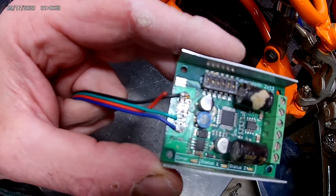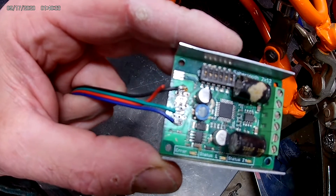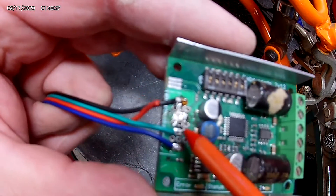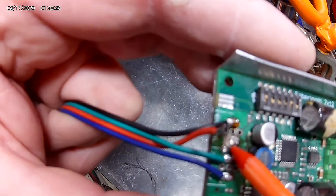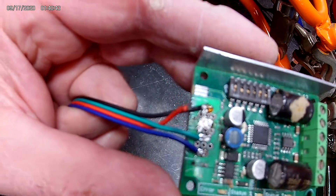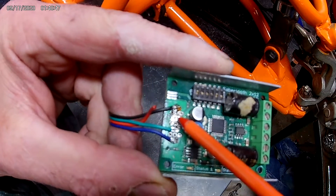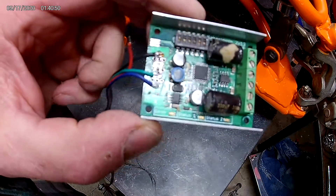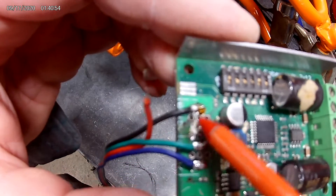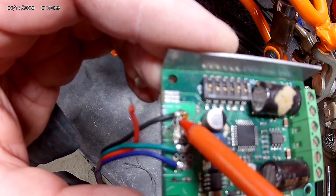I think I was probably going to use an analog signal from the Arduino to this thing. But I got looking at it, hooking it up, and I'm trying to wire it up here. But if you look right down in here, you can see that this solder pad is damaged. This thing has been in several vehicles, it's run several different motors, and I keep soldering and unsoldering these connections. The problem now is I've done that so many times, I probably overheated this one and damaged the surface. And I think this pad and this pad are shorted to each other.